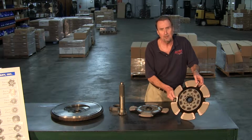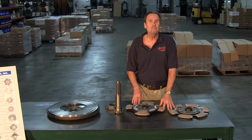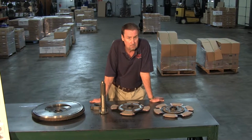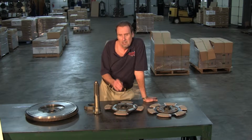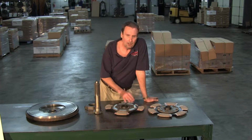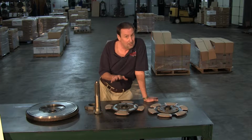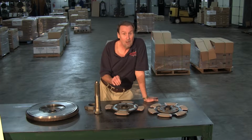This is a 6-paddle disc. This will generally raise basically your torque rating by a couple hundred foot-pounds of torque just due to the friction. Now, the advantages of a 4-paddle versus a 6-paddle has always been the clutch business. And when you're talking about a button-style clutch, the more friction you have down at one time, not only is the clutch stronger, it's less aggressive. That's the key to it. We want to calm down more or less the buttons so they're not so aggressive.